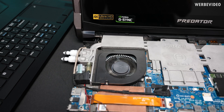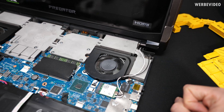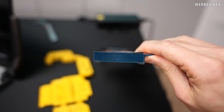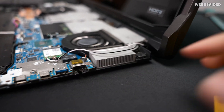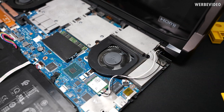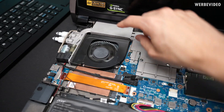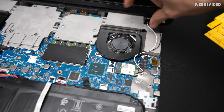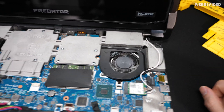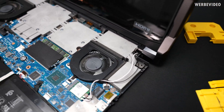It's a hybrid cooler concept — my idea was to keep the fans inside and also the base structure of the original heat pipe cooler. You can see this fin stack right here with very thin fins and a ton of surface area. Our water cooling block doesn't have such thin fins, but it will still provide some cooling. That's why I wanted to keep the original fans, because as assembled now, we have this internal pump sitting right here in a closed loop. Those three areas are basically our very tiny radiators, and the fans should have enough cooling capacity to keep things cold for normal operation — surfing the internet, office work — but probably not tough gaming or benchmarking.